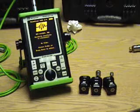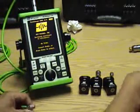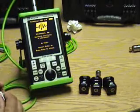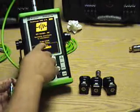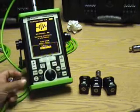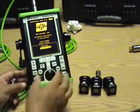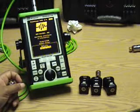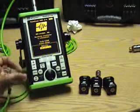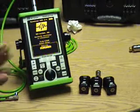If we were using a probe that does not have probe recognition characteristics built in, we would hit enter and then select within the menu. For the probes in this order, they all have probe recognition. This particular one is an L3330. By simply plugging it into the connector, you see that it says probe 330 select setup. We have two selections: a default setting which sets the gauge to all factory defaults, or the last setting of the gauge — the last setup used with this probe without saving. For every probe you select, it will have a default and last setting.